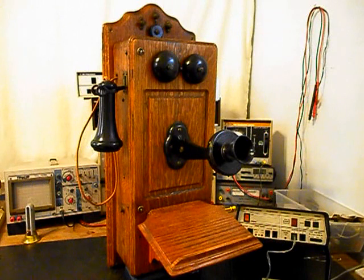We will be removing the original transmitter. We're going to install a circuit that we design and build here at the shop. It's an electronic amplified transmitter, and you will have plenty of transmit power with that transmitter. We need to rewire this unit the way we want it wired to work the way we want it to work. We're going to try to keep as much original wiring as possible, and we will need to add some wiring.